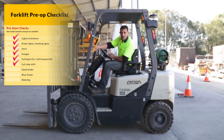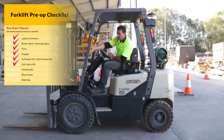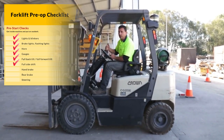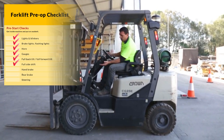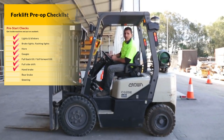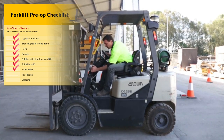As you can see, I've selected the correct travel position with the fork arms. They're below the front axle height and close to the ground. I'm now going to engage the forward gear with my foot on the brake and check the handbrake. By simply releasing the foot on the pedal, it holds. That's fine. Release my handbrake.